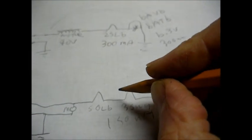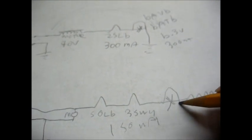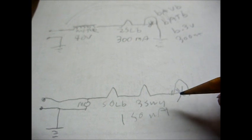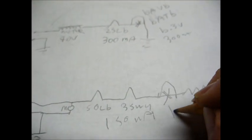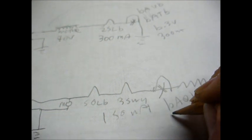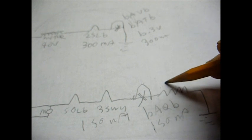These tube filaments have a current draw of 150 milliamps. So we need to select a driver tube that we can put in here — break the chain and insert our driver tube filament. We need a driver tube that draws 150 milliamps and has a filament voltage that won't throw our total line voltage figure off too much. In this case I usually choose a 6AQ6 — that's a 6-volt filament, and the tube draws 150 milliamps. The use of this tube will allow you to keep your original filament resistor intact.